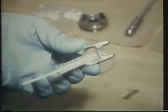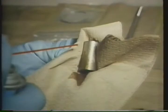Any dirt or foreign materials should be removed following facility procedures. This may require flushing or vacuuming the valve body. Reusable parts also need to be inspected and cleaned. In particular, be sure to clean the packing flange, the packing follower, and the spacer. So we've seen how to clean the parts of a globe valve. Proper cleaning is important to ease the reassembly of the valve later on and to make sure that valve operation won't be affected by any foreign material inside.